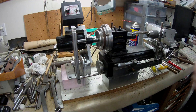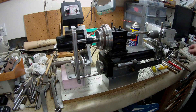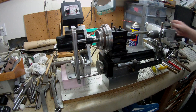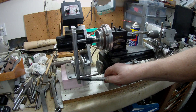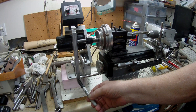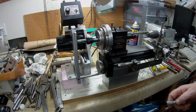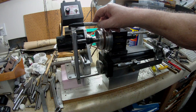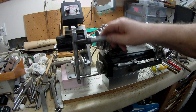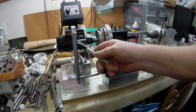If you've seen the previous video it all explains it there. What I've done today is I've put a sleeve — I've used a half inch aluminium bar — and I've done the same as Keith by putting a split nut in the bottom of the bar to clamp it to the 3/8" feed rod. At the moment it's over length and I have to cut it off, but I've got the upper hole.